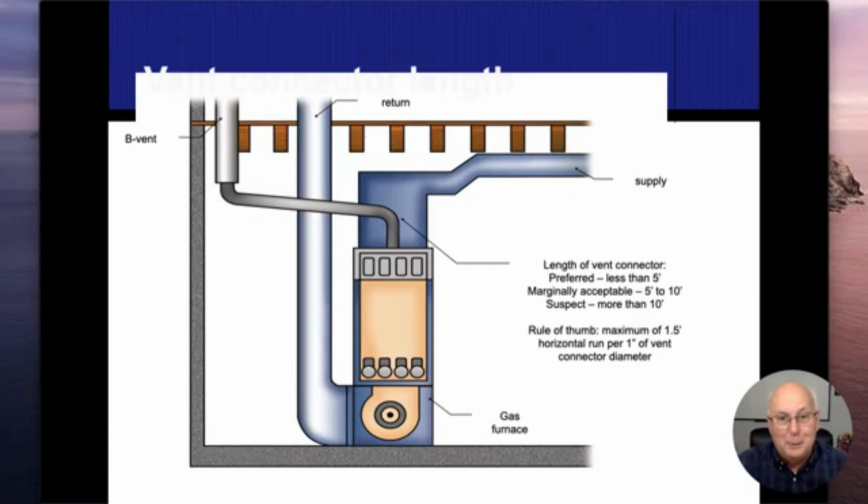So there was no damage. The measurements worked out fine. There was only one flue going up and out the top. All the signs said, yeah, this is going in there. So now their solution is either to build a fireplace with a secondary flue going to the outside, or they can go ahead with a higher efficient water heater and just direct vent it straight out the sidewall. And I believe that's the route that they're going. So they're going to disconnect it from the chimney and then put that sidewall in there.